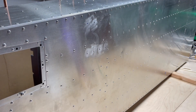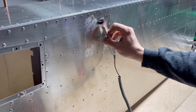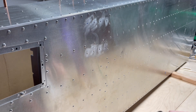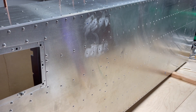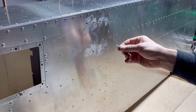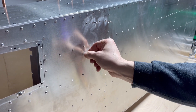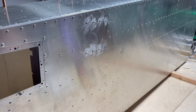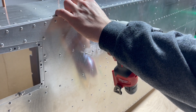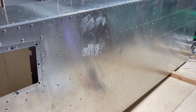We've got the tail section flipped up on its side. We're just using Jack's favorite tool here, polishing the scratches off from deburring — nice and smooth. Now we'll put in the rivets for the magnetometer mount. We first riveted the three rivets that go on bulkhead number 7, which is right in there. Now we'll rivet this from the bottom. Magnetometer mount complete.